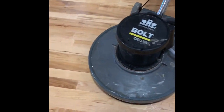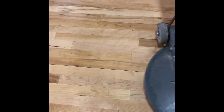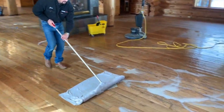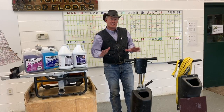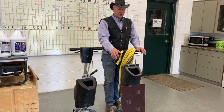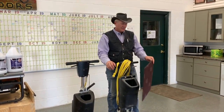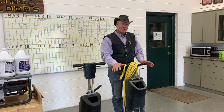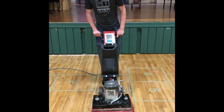You can see if there are black marks, candy, or spilled soda — it's quickly scrubbed up, and then it's easy to come behind with a floor scrubber or with a tack towel and pick up the residual foam still on the floor. After the floor is entirely clean, we will then move on to a square scrub machine. On this machine, we're just going to be using a 200-grit 3M SPP pad.